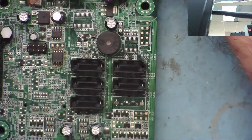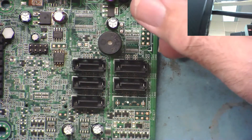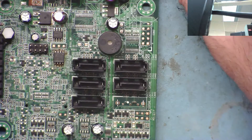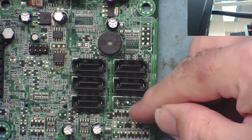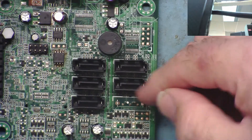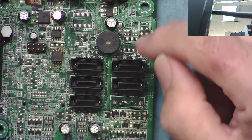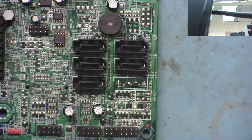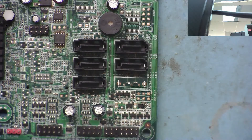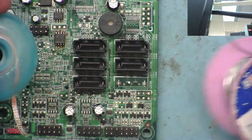I said I was going to do this without using anything specialized. Yesterday I used the vacuum desoldering tool, and I know you guys don't have access to some of this equipment. So what I wondered is: can we actually clean these holes without the vacuum desoldering tool? That was the most difficult part - cleaning out the holes. I think we might be able to do that. So just using a soldering iron, hot air, solder, flux, and solder braid - basic stuff.